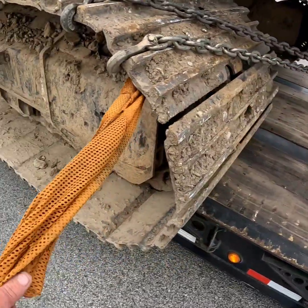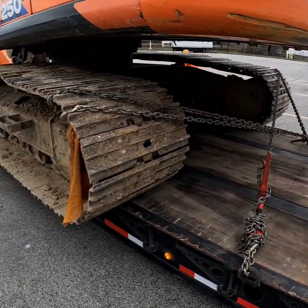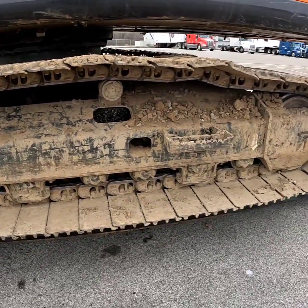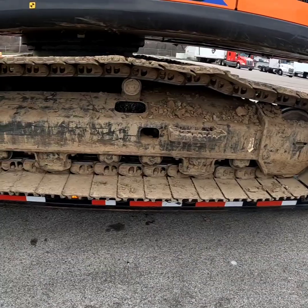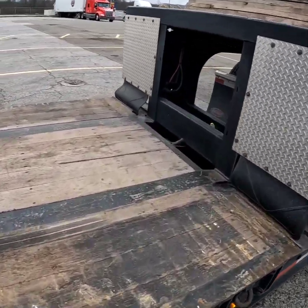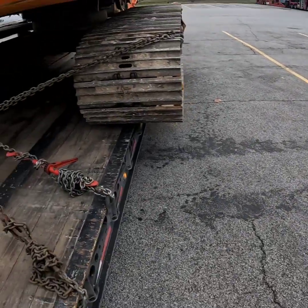This particular unit, like I said earlier, weighs about 52,000 pounds. She's 11 foot 2 inches wide and roughly 34 feet long. Tracks are a little over 16 feet. My trailer is a 40-ton trailer — it'll handle 80,000 pounds and 16 feet. The unit could be a lot heavier, although you can't permit 80,000 pounds on a six-axle setup, so it doesn't really matter.